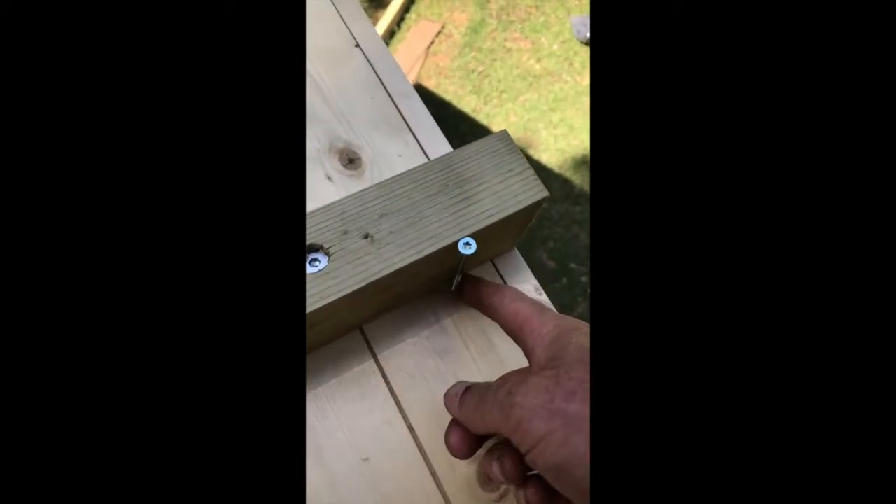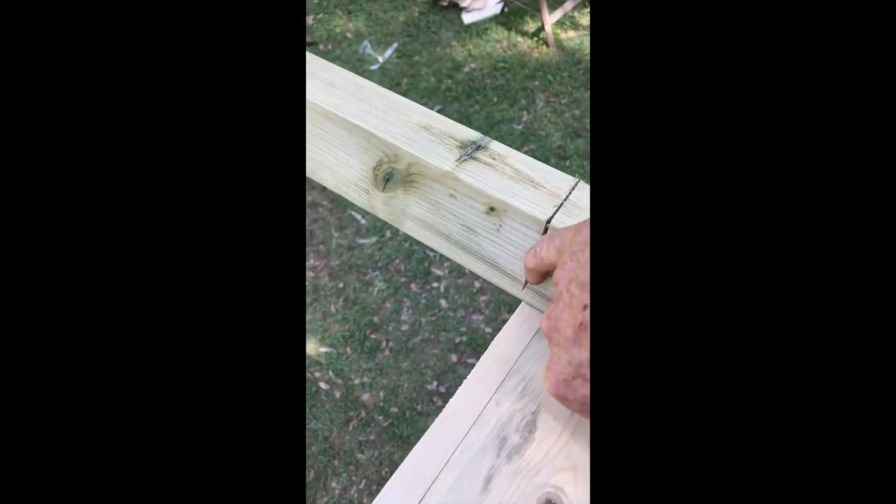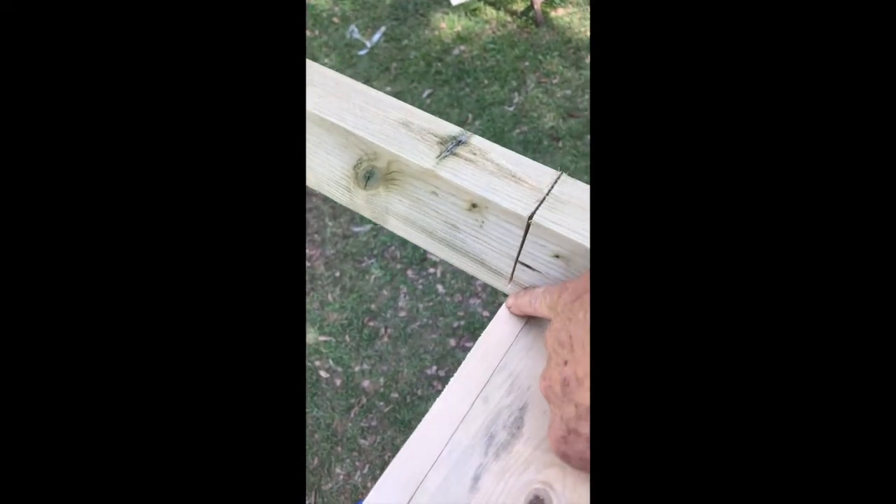You can see here we put our marker in — our screw — and I've run a string line right across. I've removed the string line now and we've started off with our batten flush on the outside edge with our fascia, and we put the first screw about a hundred mil back and then one meter from there on back. I purposely left it overhanging so I can show you that you bring your saw down here and just cut it off flush with the front section. This one has actually been screwed up from underneath.